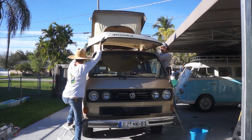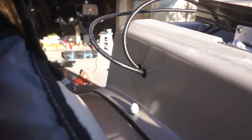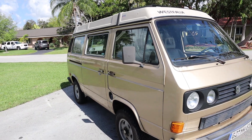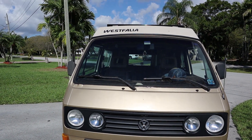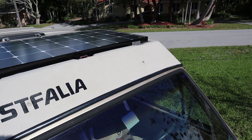Now is a good time to clean up the roof before putting the luggage rack back on. Since the rack weighed a little more, I needed some help putting it back on. The wires then had to be fed under the aluminum rail that holds the canvas onto the roof — it's a tight fit, but it works. I mounted the charge controller in a convenient spot and plugged everything in, following the manual very closely. The panel is now on and looks fantastic. The space between the panel and the rack is actually the perfect place to store stuff, so the rack can still be used. The panel is also pretty flush to the roof line, so clearance won't be an issue.